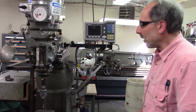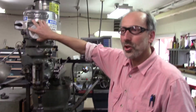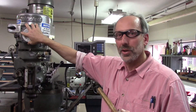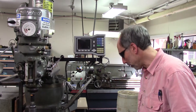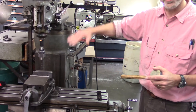The details of the rate of cut are a function of the rotational speed, the type of material, and the depth of the cut. You'll need to refer to standard tables to identify the rate of cut appropriate for your tool and your operation, whether dictated by how quickly you're turning things or how quickly you're plunging.